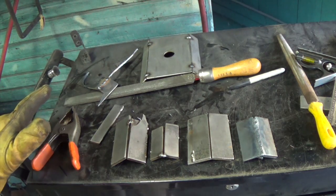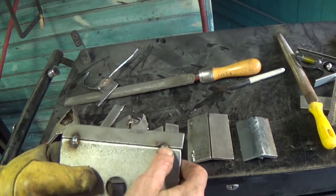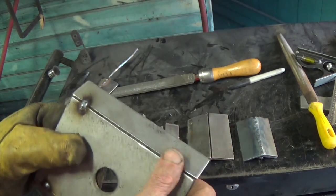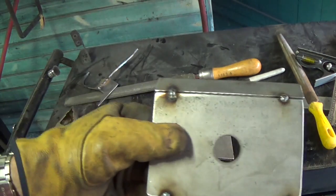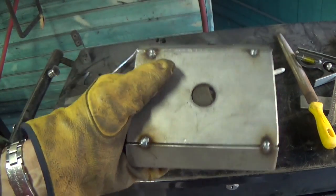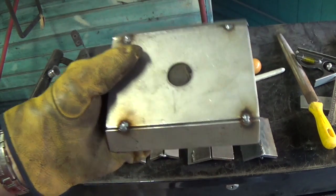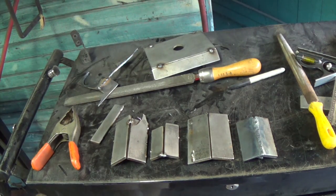So I decided that perhaps my welding issues, my grinding issues, are less welder issues and more user error. I had 0.030 wire in the welder, and it's a really small welder. I remember having good luck before using the 0.023 wire. So I put the 0.023 wire back in, and my welds are much better with the 0.023 wire.